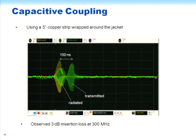But what you can see then is that capacitive coupling does work. There's something like an added loss of about 3 dB at each of these capacitive transitions, which I was surprised by. That's not a lot of loss at this capacitive coupling. So it shows that we can do this kind of probing.